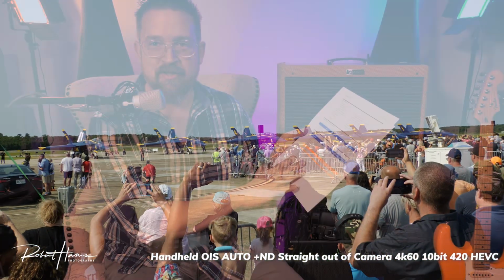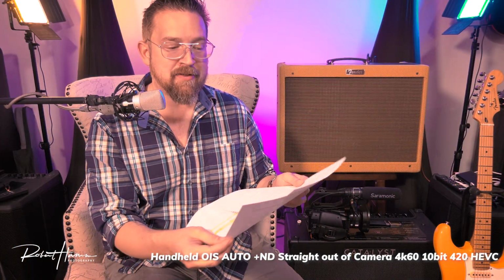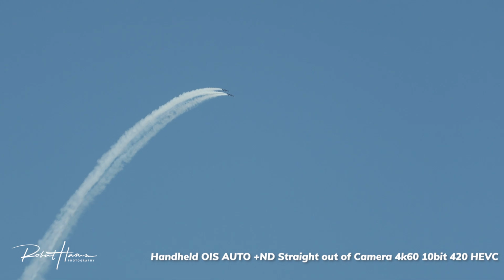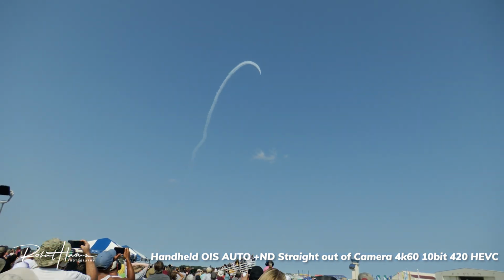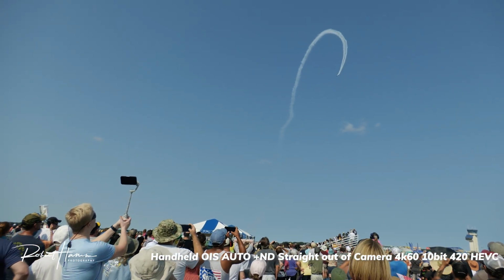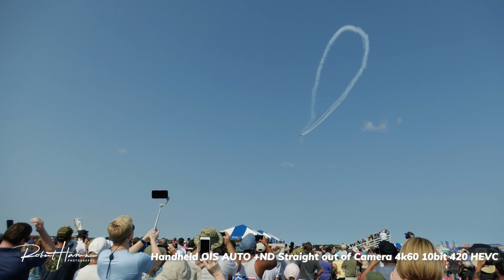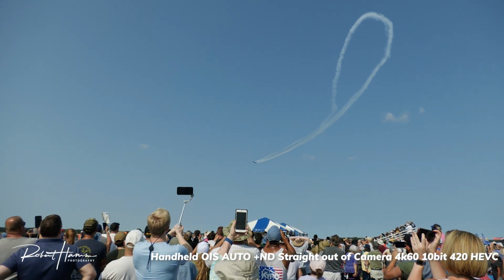All of its instruction sets seem to match the IMX 204 0KQC. So the IMX 204. And that includes everything from the 27 up to 36 decibels of gain with negative gain. That includes the 10-bit or 12-bit analog-to-digital converter, specifically the 10-bit. That includes the actual megapixels. This one matches the megapixels very well, specifically readout mode 2, 15.12 megapixels.